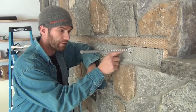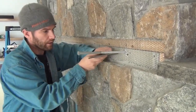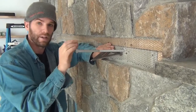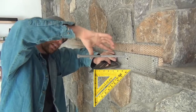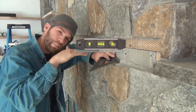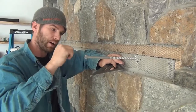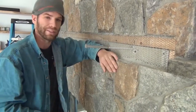I've measured this out and I know exactly where I want it. It's very important that this is square. If this thing comes in crooked going into a straight hole in that piece, it'll bind up on the hole. So I take a speed square, confirm it's good this way, and I'll take a torpedo level and set it on top. I'm not going to keep it perfectly horizontal — I'm going to lean it up just a few degrees, because I want the weight of that unit to press down on it. If anything, I can tweak it down. It's really hard to go up, because we exist in a world of gravity.